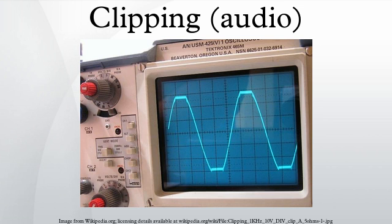Avoiding clipping. As seen on the oscilloscope, the wave resulting from the clipping is not a full sine wave. To avoid this, the overall level of a mix can be lowered, or a limiter can be used to dynamically bring the levels of the loud parts down. It is not simple to eliminate all clipping, as filtering can align various frequencies in such a way as to create excessive peak outputs. The excessive peaks may become clipped even though the amplifier can play any single sine wave without clipping. As such, some audiophiles will use amplifiers that are rated for power outputs over twice the speaker's ratings.